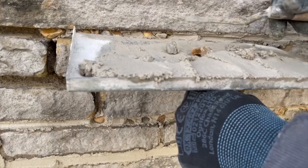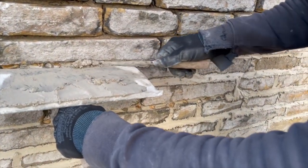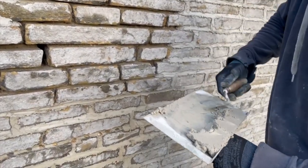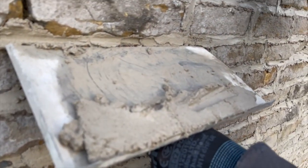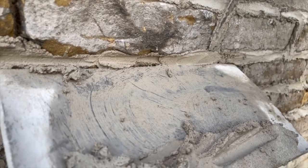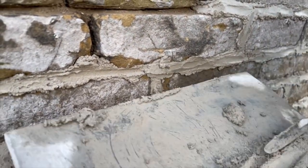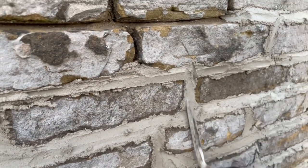You can see we've got some nice joints with stones in them, and now we fill them up with mortar - keeping each stone surrounded by mortar. Back onto the dressing trowel. Any bits in the tray - we call these 'snots' - can be worked in. As you're putting mortar in, snots will come out of the sides and you just use the trowel to bring them back round. Then as we're going along we'll just dress that mortar into the perp below so we don't forget where we are.